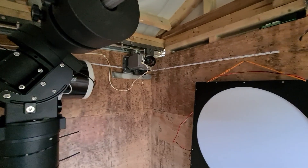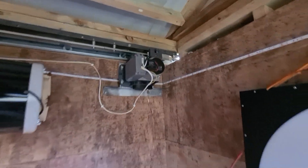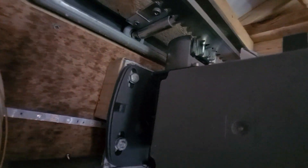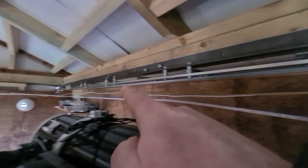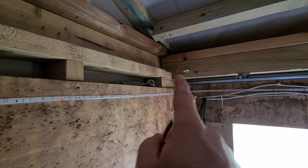The roof is controlled via a motor — this is a gate opening motor using a tooth gear. There's the motor wheel, and this rail runs all the way and goes out through a hole in the wall on the south end. I have turnbuckles here that I can use to tie the roof down if it gets very windy. We've got the SkyShed garage door track here which holds the wheels top and bottom, and that works pretty well.